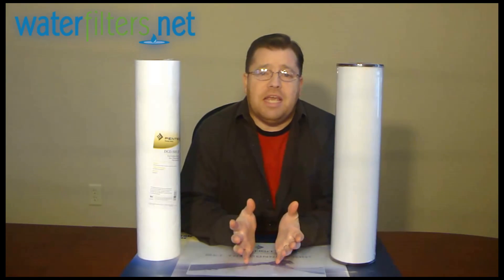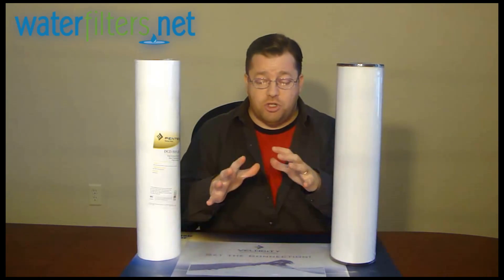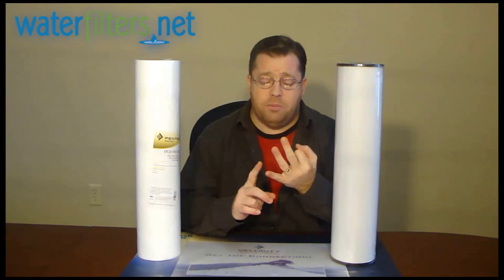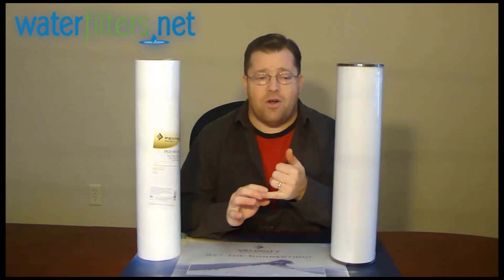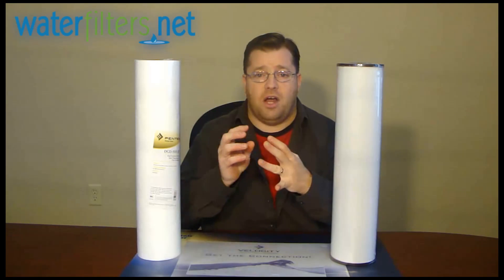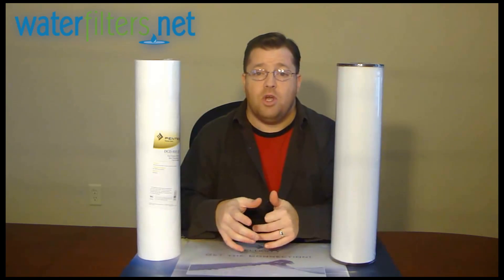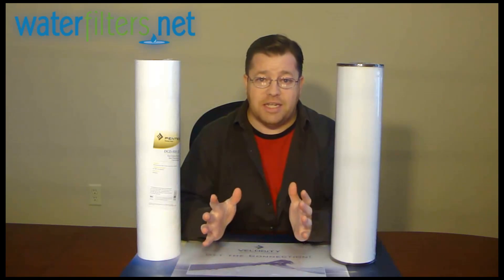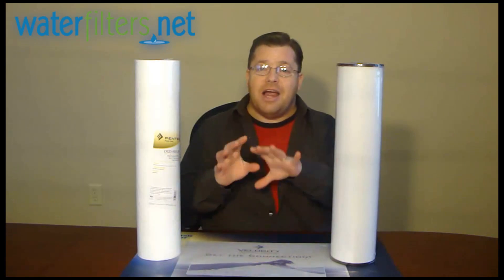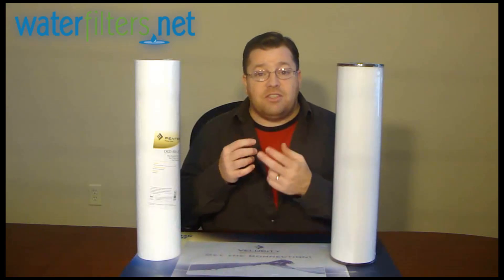Iron is going to exist primarily in untreated waters, especially well waters. It can be very complicated, but I'm going to boil it down to some general things. Iron exists in your water in primarily three forms. One of them is iron bacteria. It isn't exactly rare, but it requires special testing — you're not going to know you have it until you realize other solutions aren't working. There's no easy way to isolate it without starting out with a fairly expensive, high-quality laboratory test of your water, and that can verify exactly if you do or don't have iron bacteria.